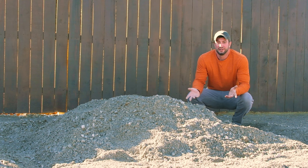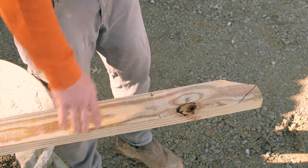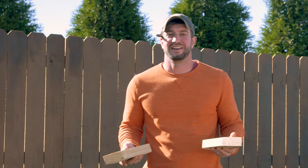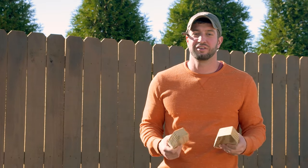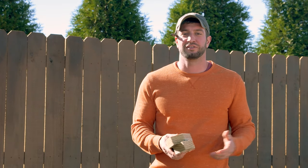You've got your hole dug and your two to three tons of rock in, but before we're ready to level our pad for where you want your feature, we need to cut some lumber to get our screed boards in place. Now we've got our stakes cut — enough with the woodworking. Let's hammer these guys in the ground, attach our screed rails, and get everything leveled up to get our base set.